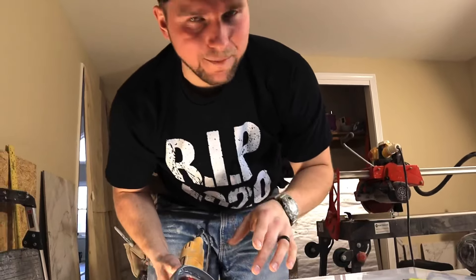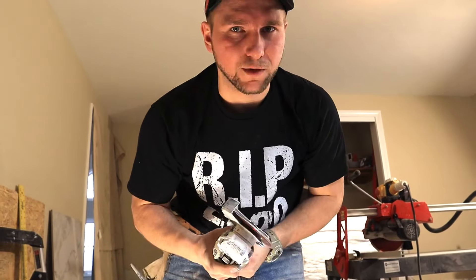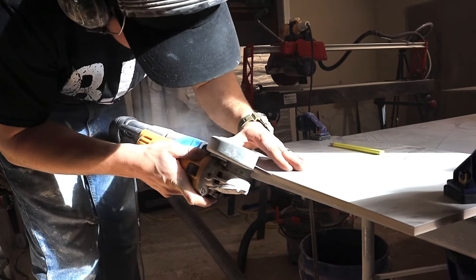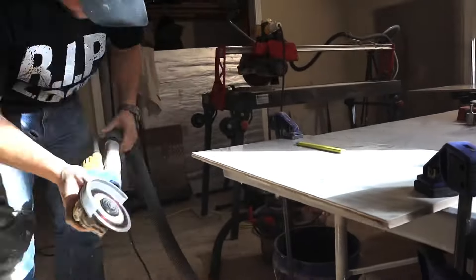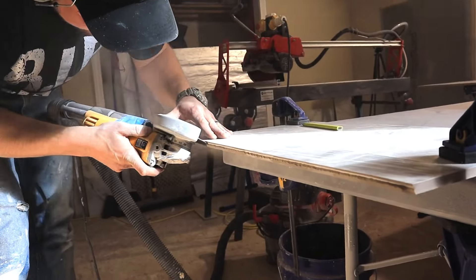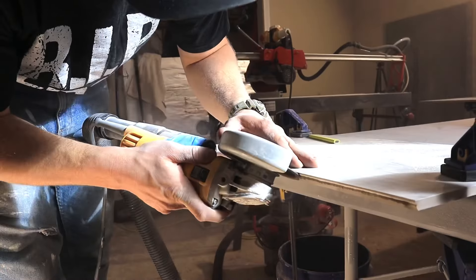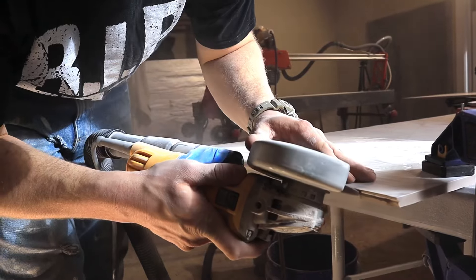Once we make that cut, we're going to polish it and I'll show you how to do that as well. If you're just learning this for the first time, make sure you practice on a scrap piece of tile before you touch any of your actual tile, because it does take a little bit of practice. But once you get it, it's actually pretty easy and you don't have to do the pencil mark or anything like that.